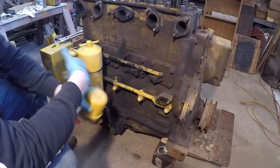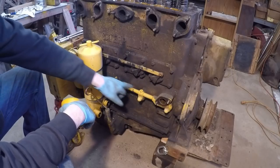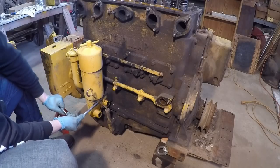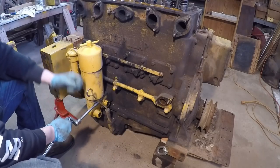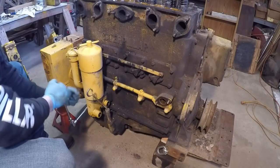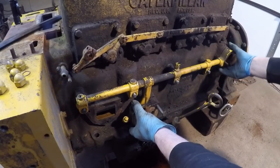Back to the story — you can see some fresher paint on some of these pieces too. I had to have all this stuff off to repair this oil manifold at one point; the solder joints had fatigued, fretted, cracked, and were leaking. Got all that squared away, put it back on, refreshed the breather while I had it off. I also changed the oil filter over — it was the earlier bypass system that only filters a portion of the oil being circulated, but I had the full-flow setup, so I went through that. It does a much better job of filtering the oil because every bit of oil that's circulated has to go through the filter with this setup.